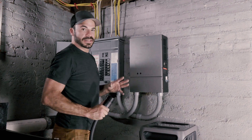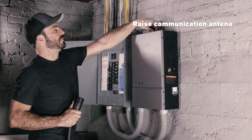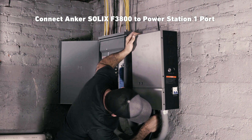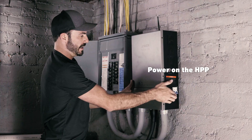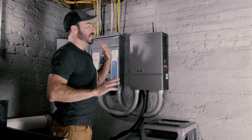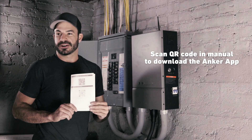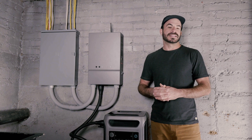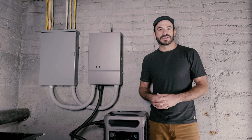Now that we've made all of the main electrical connections between our backup panel, main panel, and the home power panel, it's time to make the final connection between it and our F3800 and commission it. We start by flipping up the communications antenna for Wi-Fi, then use the supplied plug to connect to the power station — plug it into port one and go until you hear it click. Do the same on the F3800. Then flip both breakers to the on position and hold the on/off button for two seconds — and the house is back up and running, with everything on this panel powered. Now scan the QR code in the manual to download the Anker app and learn how to set up, configure, and control the system so it works for you. That wraps up the installation of the Anker Solix home power panel and F3800 — like and subscribe to stay up to date.